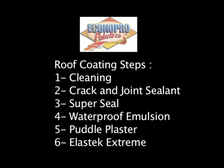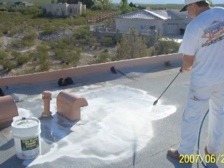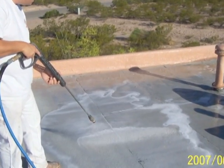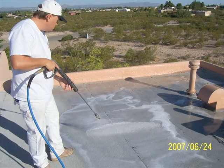There are several steps involved in roof coating. The first step is cleaning. We use a pressure washer with a chemical such as TSP and scrub roofs. Apply the chemical and wait five minutes before rinsing. Change the tip and rinse with high pressure. Remove dirt and loose roofing granules. You may need to rinse the side of the building. The roof will need several days to dry.